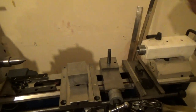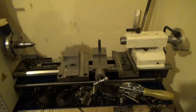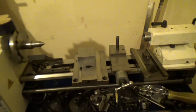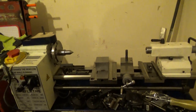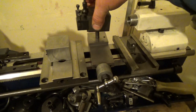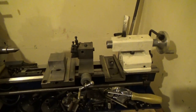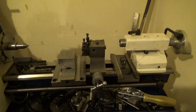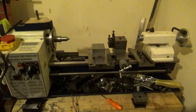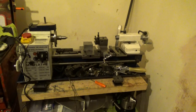I'll have four tool holders so I can have eight tools set up for a quick-change tool post arrangement — just swap top nuts, add another, tighten, and you're doing the next job. I've got the quick-change tool post for this lathe and it fits beautifully. I will be making some of those on the shaper very shortly, and it won't be long until I can test it out.